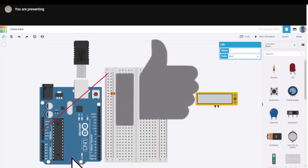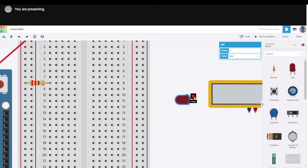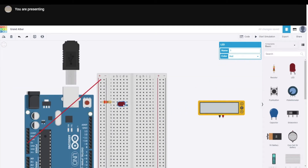If the LED is oriented that way, you'll have to turn it so the anode connects to the positive part and the cathode comes out to the negative. You'll see what I mean once I connect it. Right now electricity is running from five volts into the positive terminal, into the 220-ohm resistor, through this line to the anode, and then out the cathode. Now I just need to close the circuit, so I'll add a line from pin 9.